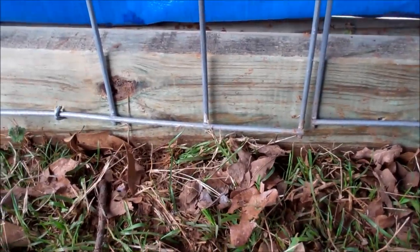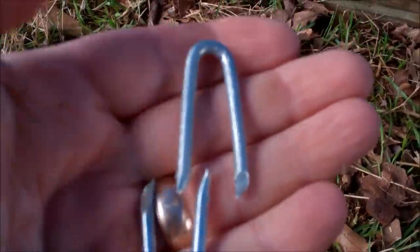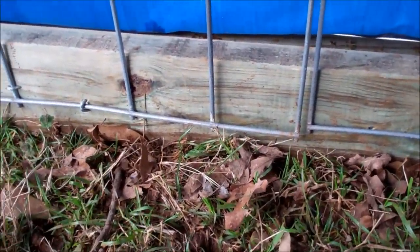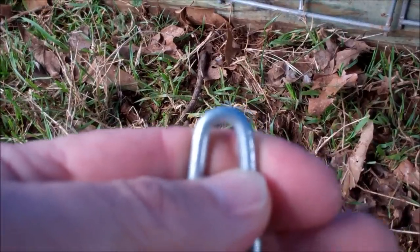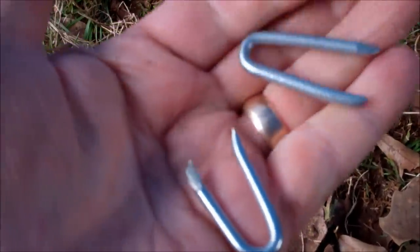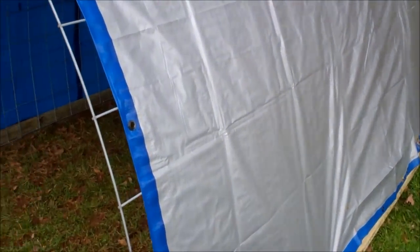Because I know I'll be pulling this from one pasture to another — especially doing rotational grazing — I'm putting braces on the sides. I'll put a brace there and there. For attaching the cattle panels, you use fence staples. Use the inch-and-a-half fence staple, not the one-inch. You want that extra half inch because you lose some penetration over the cattle panel rod, which is about a quarter inch. Inch is not good enough — inch-and-a-half.